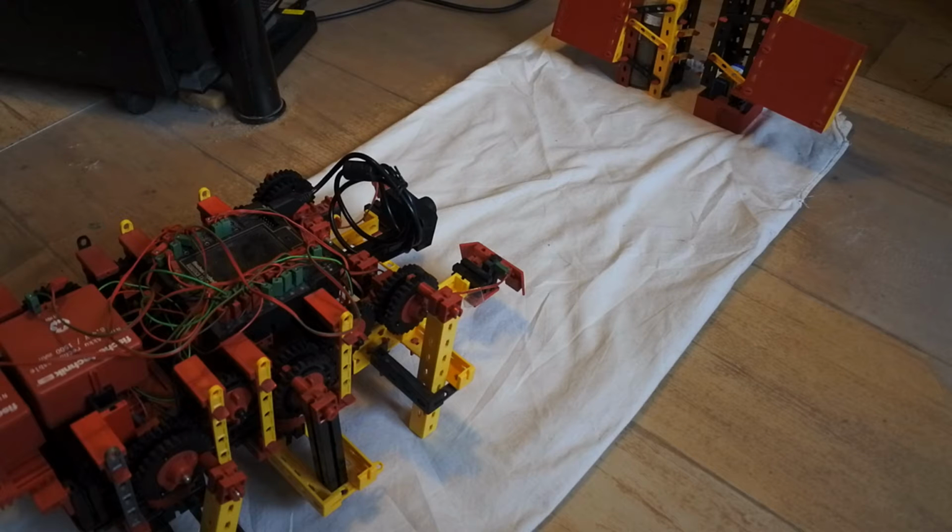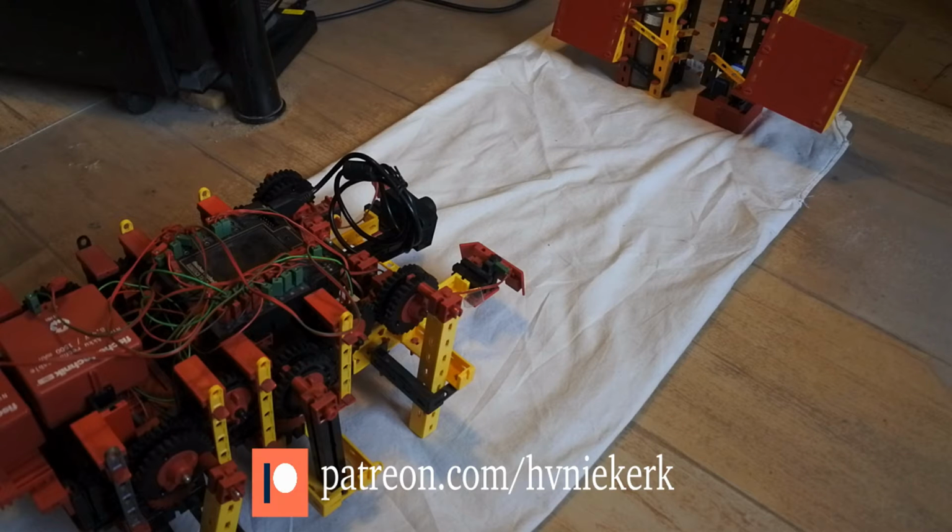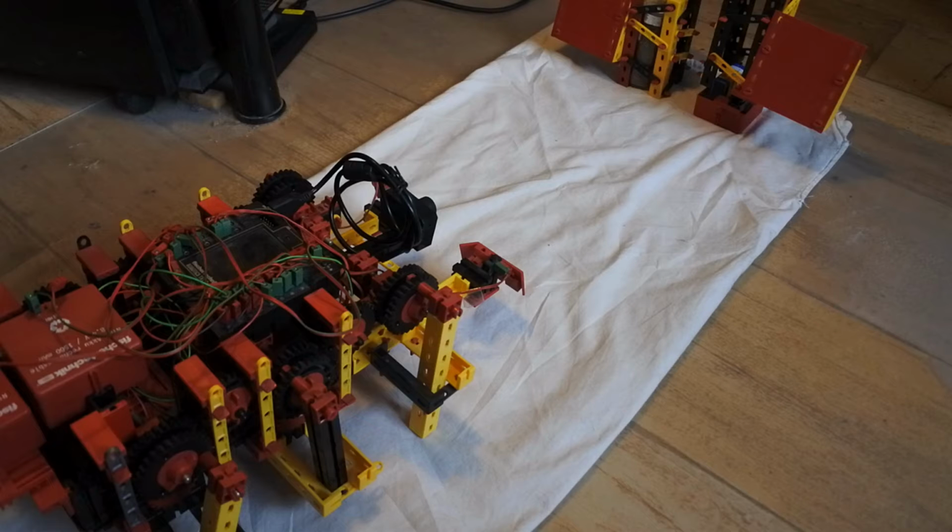As you can see, this video is focused on my walking robot Mirft2, based on the TXT controller, all with fischertechnik. The controller is running embedded Linux and is programmed in Python. Last time I did some extensive walking tests, and to my surprise I had to reverse the walking direction again, because it turned out to be walking backwards instead of forward. However, there are still some issues with the gears and also some issues with the color separation, which I need for these objects to separate the red and turn every other color into black. So more walking tests and OpenCV tests for this episode.